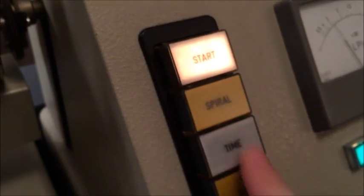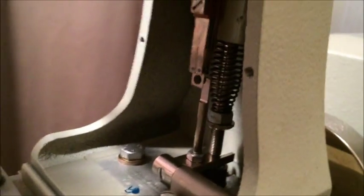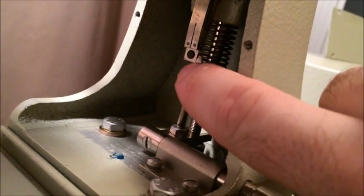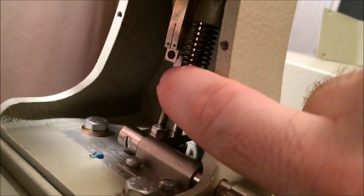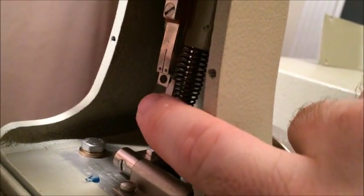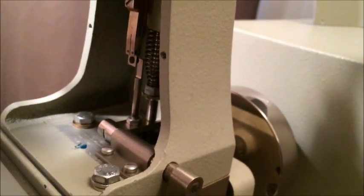This little lever here — when you push it forward — is what allows the switching from start to stop. If I do this right now, you'll notice how it knows to do a full stop and an immediate cutter head release: this reed switch makes the connection the other way. When it's pushed forward, that's an all-stop. When it comes back to rest, it should have the connection that allows the lead-in and the end groove.